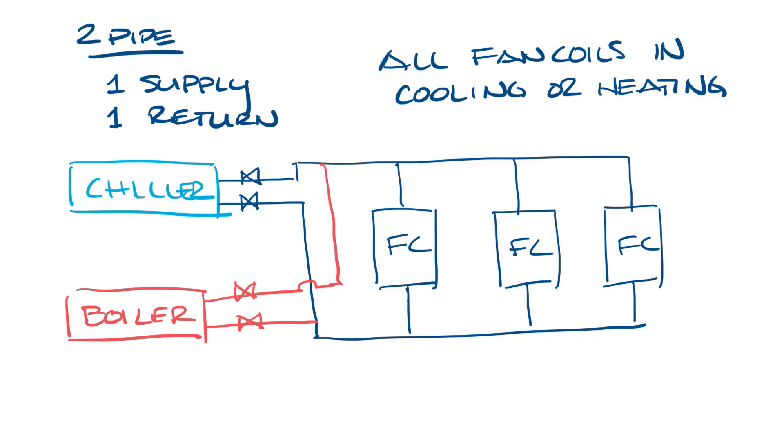A two-pipe system is operated in cooling in the summer and heating in the winter. In the spring or fall, when the weather can be in between hot and cold, or maybe unseasonably hot or cold for that time of year, the building occupants may be uncomfortable. Many years ago, I was staying in a hotel in Ohio and it was like September 29th and it was 30 degrees and snowing outside and the room was freezing, but the hotel's two-pipe system was still in cooling mode and they told me they didn't switch the heat until October 1st, so they gave me some extra blankets.